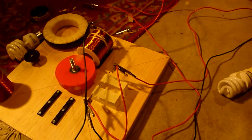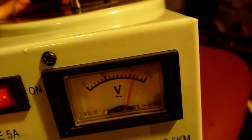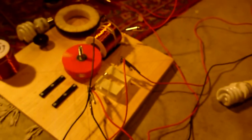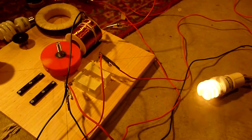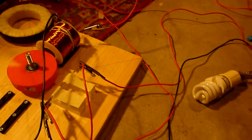As you can see, the rotor is spinning and the light is flashing. We're going to decrease the input by moving the Variac. We're now at 78 volts. The rotor continues to spin and the light continues to flash — there's very little perceptible difference between what it was and what it is now, even though we cut the input roughly in half.